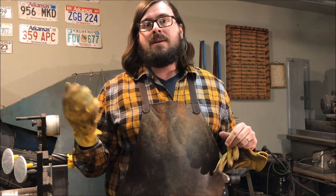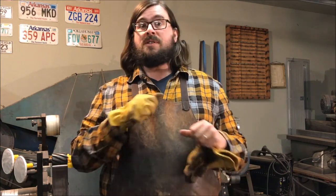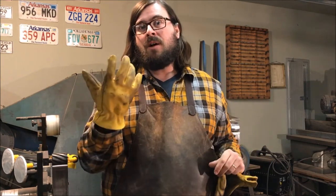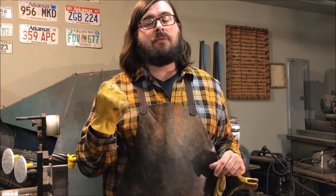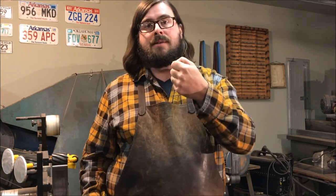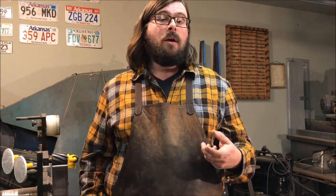With just regular work gloves it wants to slip out on me, so I don't use them a lot — but maybe if I'm going from not forging very much to forging solidly for a week, or doing a whole lot of something, and I want to have a glove on my hand, or maybe I have a blister on my finger that I'm wanting to baby, maybe I'll use a glove for that. Another type of glove you probably want to use is a welder's glove. Those are really handy for when you're holding hot stuff, and if you have a really heavy item that's soaked up a lot of heat, having that welder's glove on your tong hand — or if you're using a full-size steel bar and not using tongs at all, those bars can get pretty hot. So I like the welder's gloves.